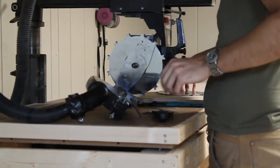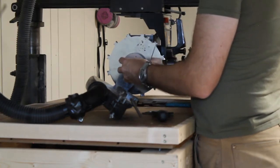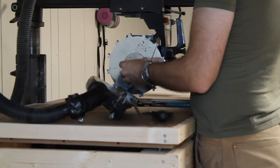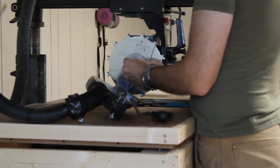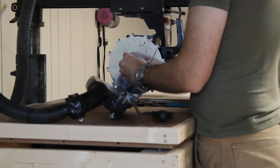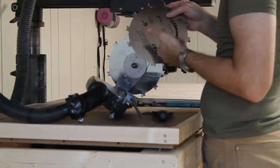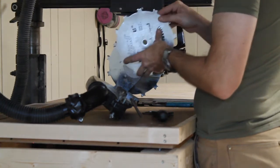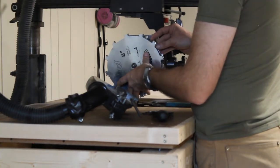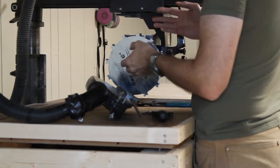And then lastly, we're going to put our other set of shims on. With these thinner shims, it's kind of finicky because the whole diameter is about the same as that arbor shaft. And because of the threads on the arbor, those really thin shims can get stuck in there. So you want to make sure you're not going to end up bending them when you tighten things off. And we've got the print now on the outside of the dado stack.